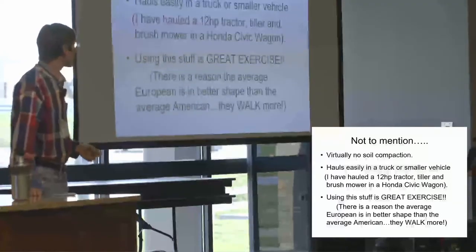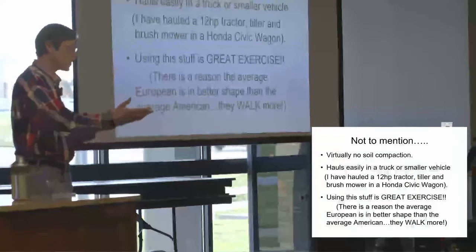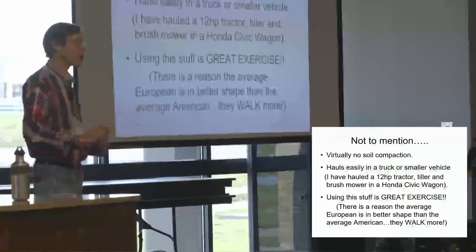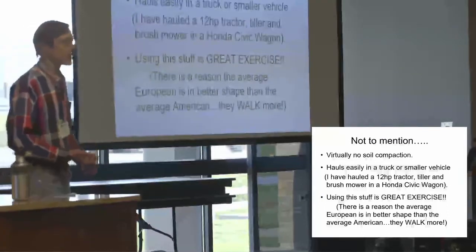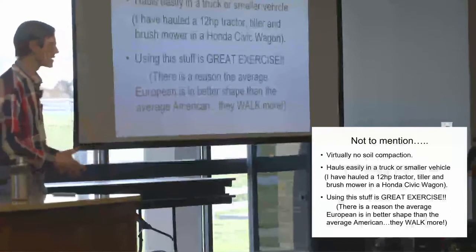Now there are some tasks you would be doing on a bed where you need to straddle. For example, if you're running a multi-row seeder, you don't want to have tire tracks on top of the bed because the implement is not going to erase those tracks, and you don't want to plant into a tire track. Same with a plastic mulch layer or the bed shaper or anything like that, where the implement is not going to erase the tracks. Then straddling is kind of a must.